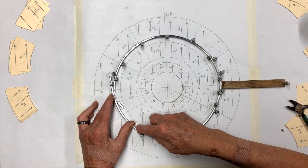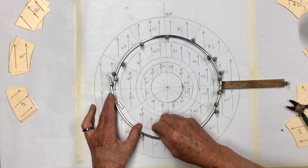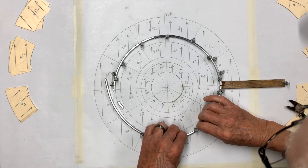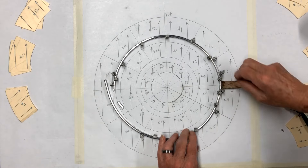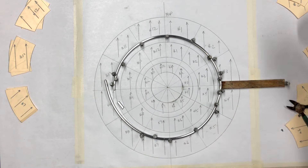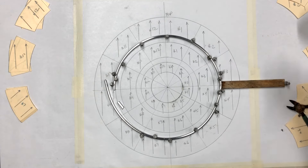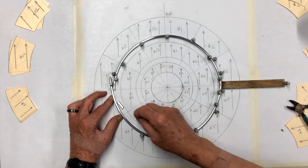When you get up to where it's going to overlap, keep an eye on it and make sure it stays flush — you don't want the came up in the air. The joint here will actually be hidden once we get the piece together. Take your time, slow and steady is better than cutting too much and having to figure out how to piece it back together.